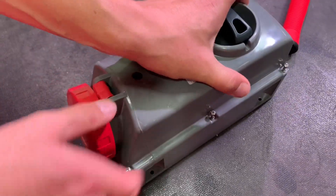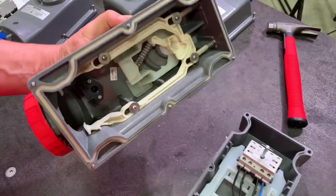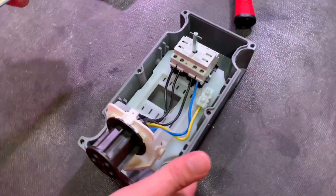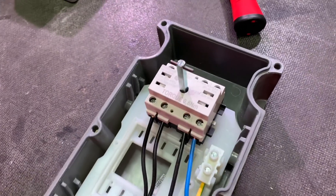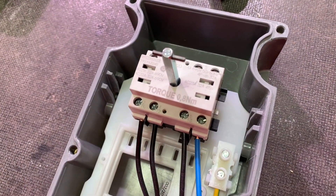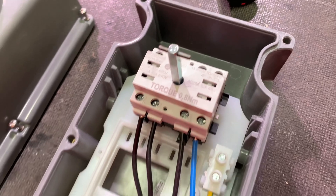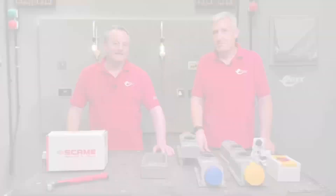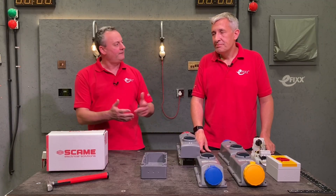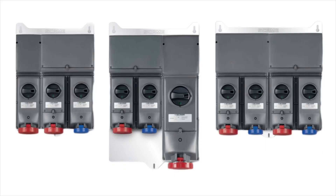What I really like about this modular nature is that if you have damage to the isolator, you can change the front housing or just the socket assembly without having to change everything. GRP is quite an investment when putting these into an installation, so it's great to have that interchangeability and ease of maintenance. The switch could fail over time — you just replace it keeping all other elements in place, which massively cuts down on maintenance costs. They also do other variants: a common back box to take different socket arrangements, and you can add an expansion to allow circuit protection to be included locally as well.